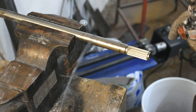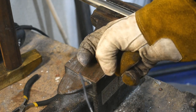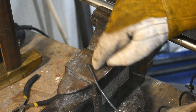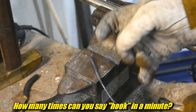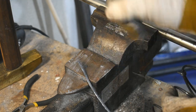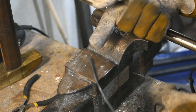Okay, that's probably a long enough section - it doesn't have to be perfectly straight. Now for making the end. I want this to be like a hook, a little hook thing, so I can poke it underneath a gasket, turn it to get the hook under there, and then pull to pull the thing out. This little tool would be super handy - something with a little hook on the end, which I don't have in the toolbox right now. What I want to do is pound a flat end, then pound a little hook in the flat end. It doesn't have to be sharp - just having that little thing in the toolbox will help immensely.